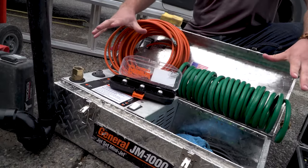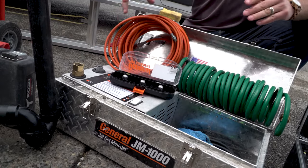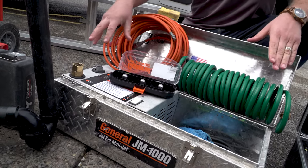You can start with a very simple jetter — this one's good up to four inches — but you're definitely going to need a hydro jetter. This thing pressure washes all the drains inside the pipes, can clear out tree roots, cleans out sludge. Very important equipment when you're talking about a drain cleaning arsenal.